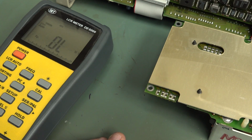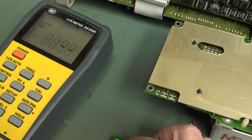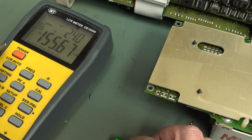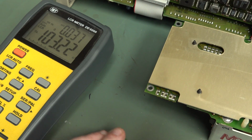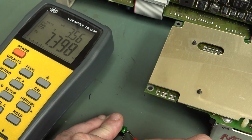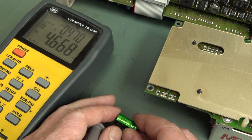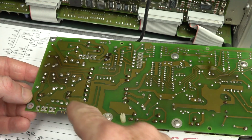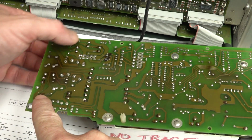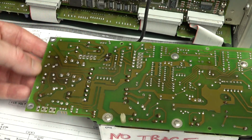So I sucked out that secondary cap, the output cap, 0.22 ohms. That sounds pretty good. That's what we had before. So let's change our frequency back. 100 microfarads, and that's, oops, off camera, 100 microfarads. That's what we expect. So that cap's actually in good nick. It's a Nichicon. All right, so I'm going back to these other caps here, which have all been sucked out.